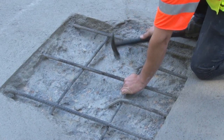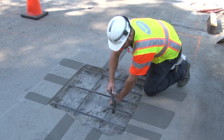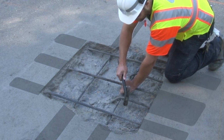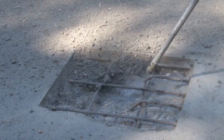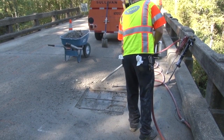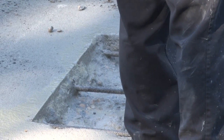Sound the bottom of the hole and out along each rebar. If it sounds hollow over a rebar, enlarge the hole to chase the rust. Water down any dust and debris in the hole and then clean it out with high pressure air. Do not blow dust into the air and do not blow debris off of the bridge deck.